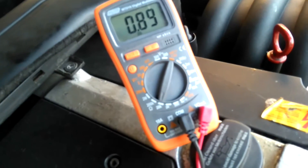Just getting the leads working — trying to hold the probe leads in one hand is quite challenging. Basically, there's a screw in here. A flat head acts as an adjuster — you're going to turn it until you reach 0.86. Turn it right to decrease the reading. You have to be delicate. And my potentiometer is now set.